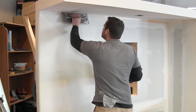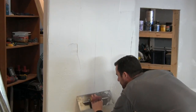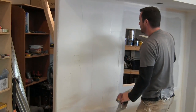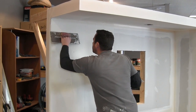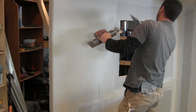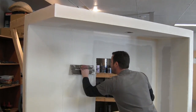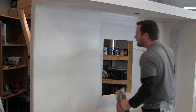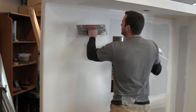I want to make sure that inside corner is done well. I can see that pencil mark from before, so I know that I'm down to a point that's safe. Most of my weight is against the bead. Now I do have some ridges — that basically happened when I went on the left and right side, so now I'll go down the center again.